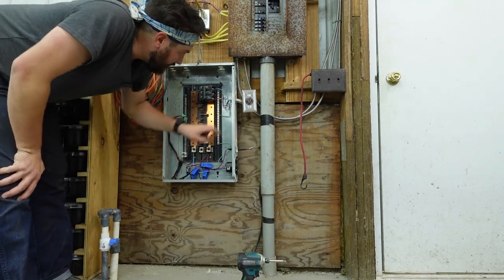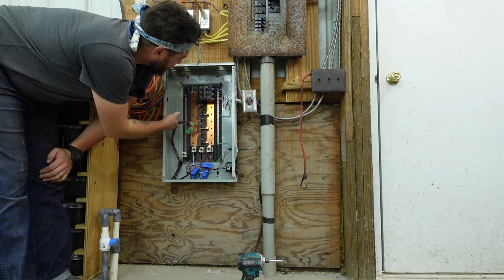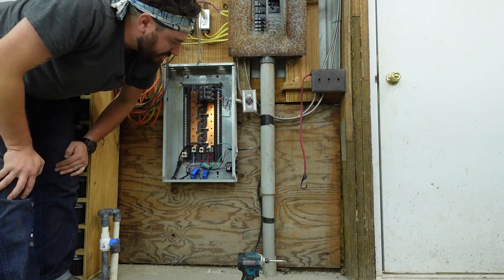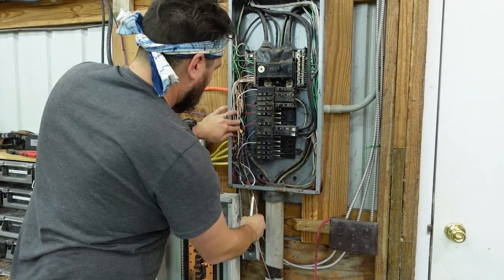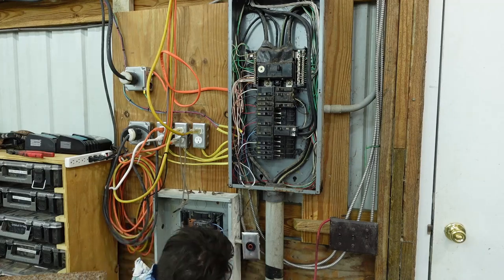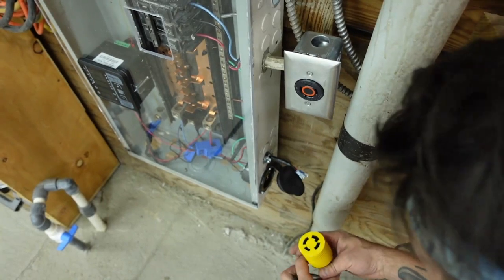So off camera, I put this outlet in. It's just in a box here to the side of this, going into the three phase. The panel can go on, and I can put these connectors in. This is bonded to the ground. I need to get all these grounds on the same ground plane so that there are no loops or anything troublesome. We're ready to go here.